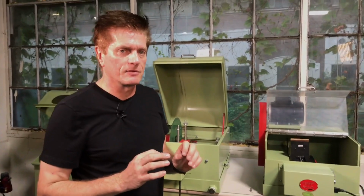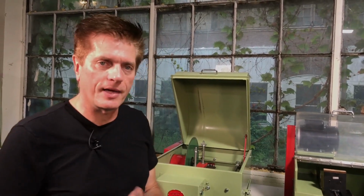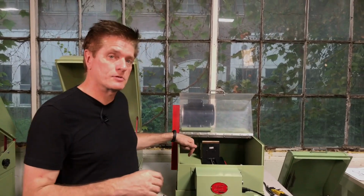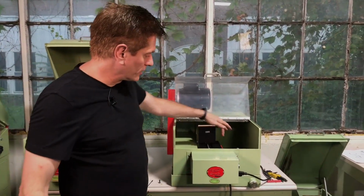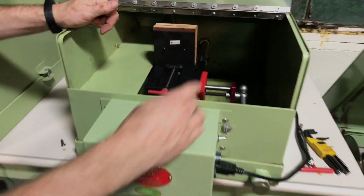Now you can run water in the other saws, it's a separate video I'll talk about, but the basic rule of thumb is you're only going to usually run water if you're cutting a stone that is extremely porous and sensitive to discoloration with coolant. 99% of what most people cut is not that issue. Usually when people think about water, they're thinking, oh, maybe this is going to save me some money. Guaranteed it won't. The reason why is it's going to cause a lot of the componentry within the saw to rust and seize up.